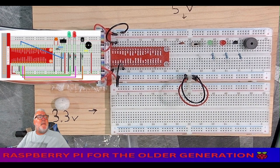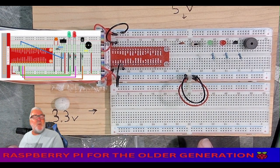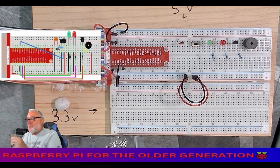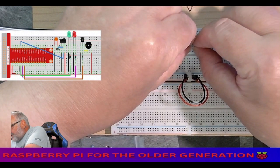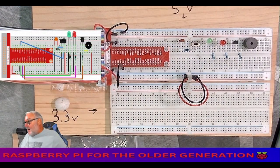And then our final one is our 1K resistor. What was that one I just put there? They were the two, that was the 220 and the 10K. And our 1K resistor. Let me just bend it. That goes from our left leg to the center leg of the switch. So the left leg of the capacitor to the center leg of the switch, like that. All right, so that's our resistors done.